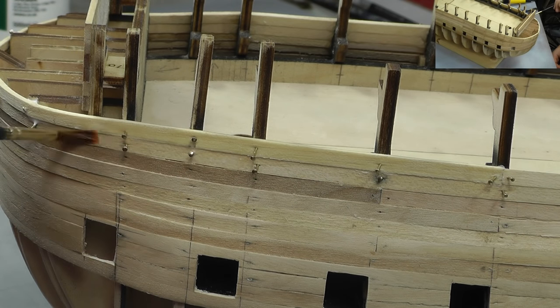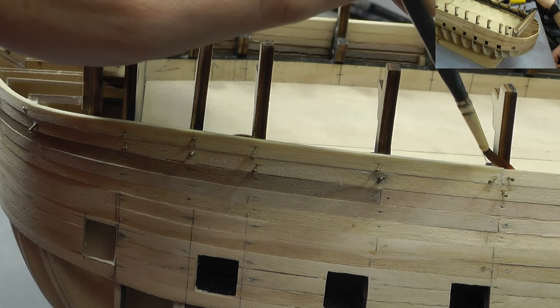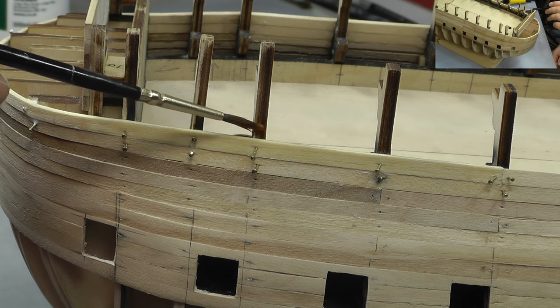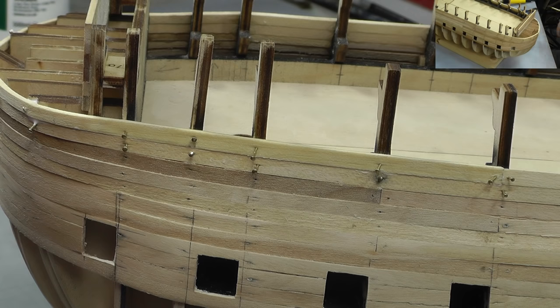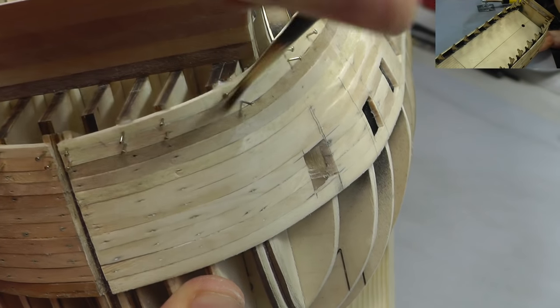Not only that - I haven't really got much going on at the tops here, but at the tops you also want to wipe these down and clean these up. Because if you get a little blob of wood glue there it will raise the surface, so when we come along to put our next plank on top it's just going to bulge it out a bit. So cleaning it up is a stage you do want to take care of.